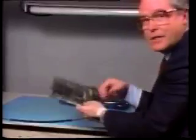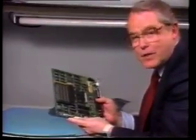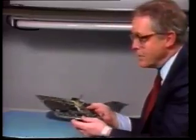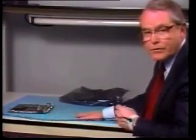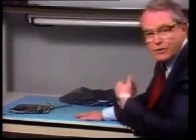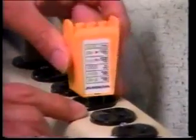By the way, we used to think that once the chip was mounted on the board, it was no longer susceptible to ESD damage. Not so. In fact, the possibility of damage actually increases because the traces and leads on the board act as antennae. A proper workstation will have a conductive mat grounded to earth ground, to which the worker attaches a wrist strap cable. When we say ground, we mean real earth ground.